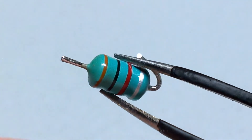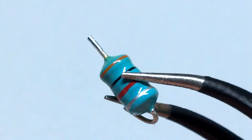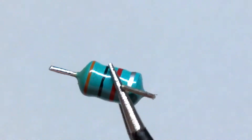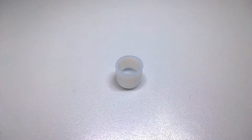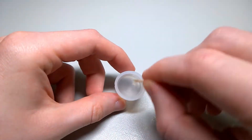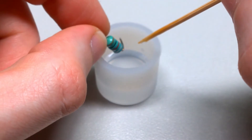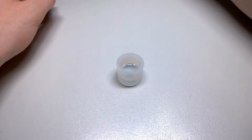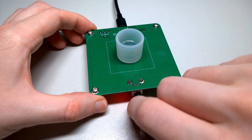Now this inductor that's failed — I'm actually quite interested to see how it's failed. I'm not sure if some of the windings have overheated and fused together, or maybe exploded inside, or if it's just a thermal cycling thing and some of the wires have broken. So I think it's a good opportunity to do some more advanced failure analysis. I'm going to prepare some two-part epoxy, mix it together thoroughly, and then put the inductor in and mix it around to make sure all the surfaces are wetted. Then I put that on a little hot plate I made for a couple of hours.